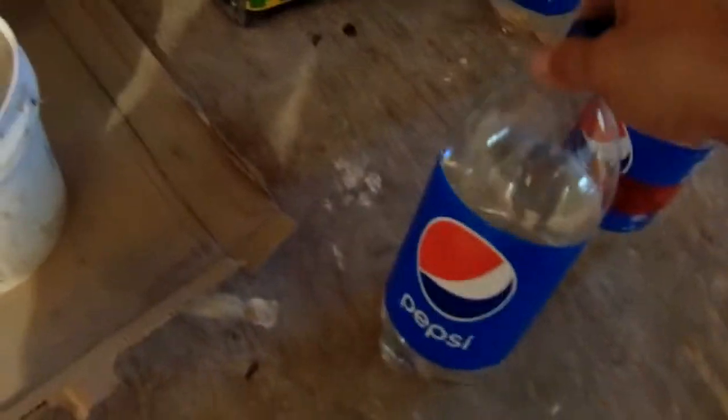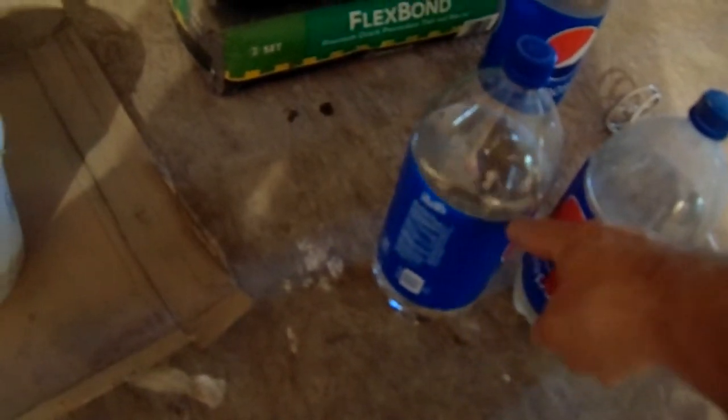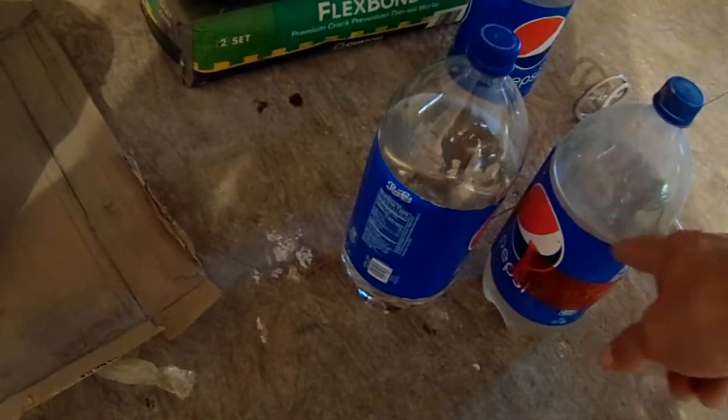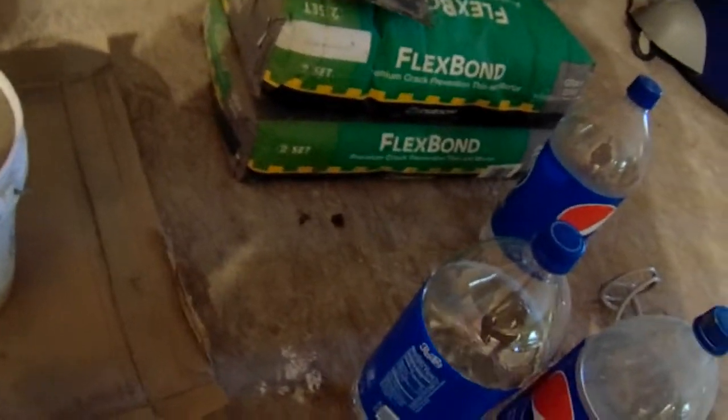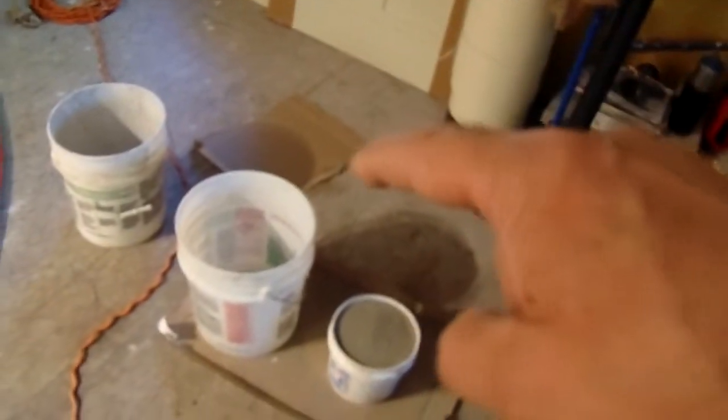And what I do to mix it up is I take a 2-liter soda bottle and bring it up to approximately the top of this line of the label itself. They're pretty much all in the same place. But that gives me pretty close to what I need for water when I mix this up. I may add just a smidgen, a little bit more, half a cup or something, to fine tune it, but that's it. So I put the water in, I put a pre-measured 1/4 bag in there at a time,